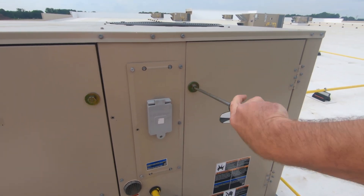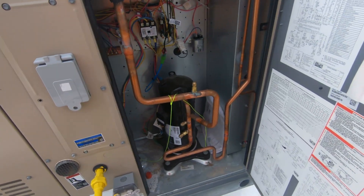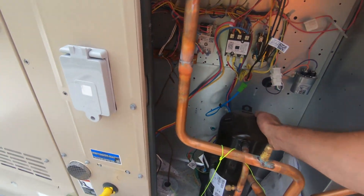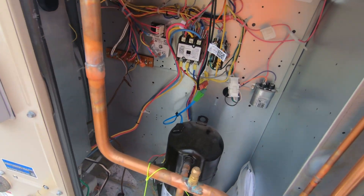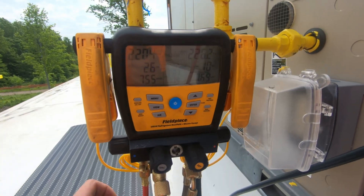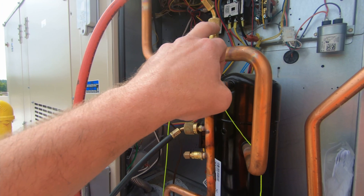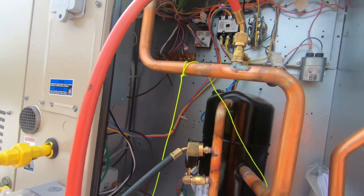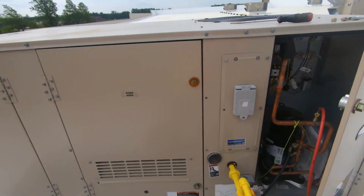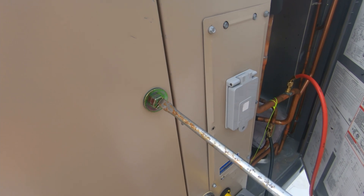There's air movement in the store. Yeah, here we go — contactor's pulled in and she is hot, very hot. Alright, let me see what we got. I've got 220 pounds of standing pressure, more than likely off on thermal overload. Looks like Lennox is moving to the CoreMax fittings as well. Let me check this blower, make sure it's running the right direction, and then I'll kill power and we'll cool this thing off.